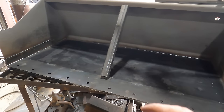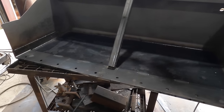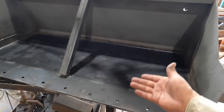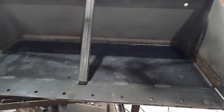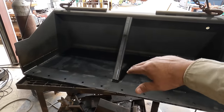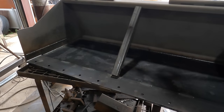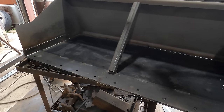And so now I'll just flip it over, weld the back side of that, and then put those wear strips on. I don't exactly have wear material, so I'm just going to be using some 3/8 flat bar. It'll be fine. It's going to be a long time. By that time, the top half of this, I think this is a sweeper bucket, the top half of this will be worn out, so this is new. All right, let's turn this thing around.